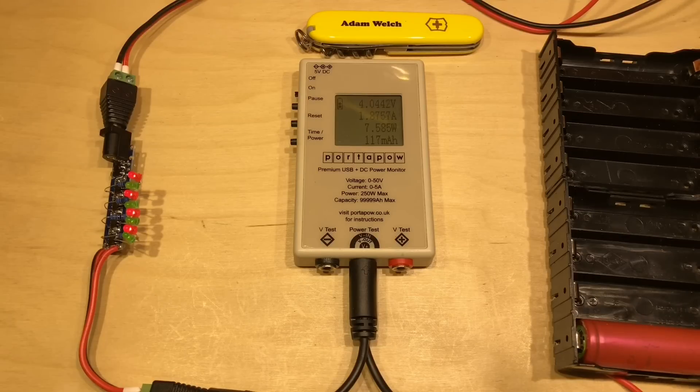Over the last couple of days I've charged and discharged this 18650 a few times. It has about 1700 milliamp hours, so it's a lower capacity battery. Putting over 2 amps in is probably charging it a bit aggressively, and it's had a hard life — I've been discharging it at 1C as well, 1.6 amps. But that has allowed me to monitor what's been going on.